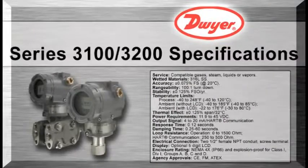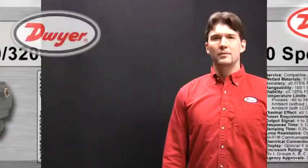The 3100 and 3200 pressure transmitters are a micro-based pressure transmitter with a 0.075% full-scale accuracy. Both transmitters are available with FM or ATEX approvals. They both offer a 100-to-1 turn-down ratio, have a process temperature limit of -40 to 248 degrees Fahrenheit, a 4-to-20 analog signal. They come standard with HART 7 communication and are available with an optional 5-digit LCD display.